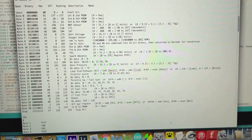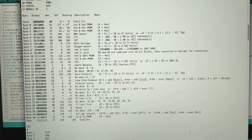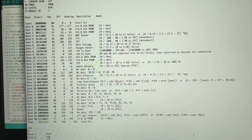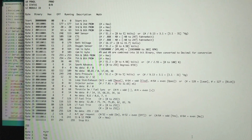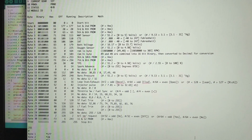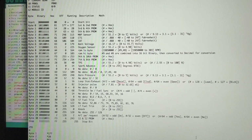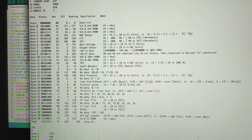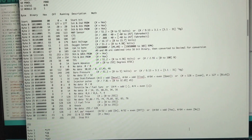Okay, so now that you have your connection, you need to figure out what you're looking at. The way that the Jeep outputs data is actually really simple. All it does is output a string in a continuous loop over and over again at something called a baud rate. Now, I think it's considered a UART. There's no timing signal. So literally, the timing is the length that the bit stays either on or off. There's no secondary clock signal or anything like that. It's literally just one line, one TX pin, that's it. And that's where all your information is.